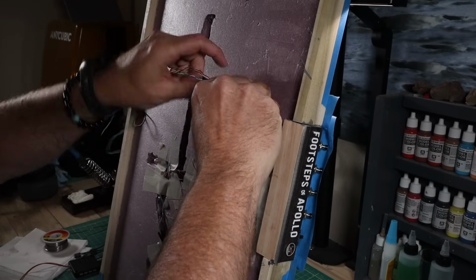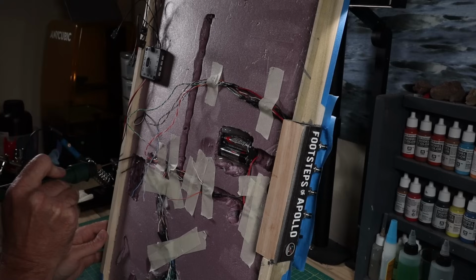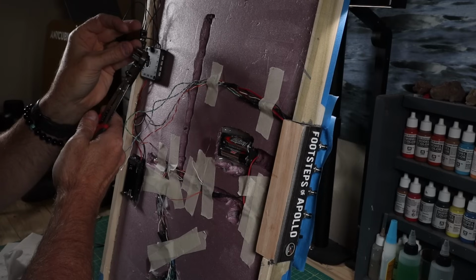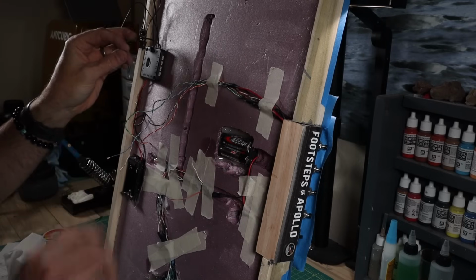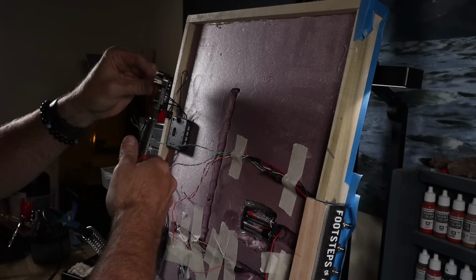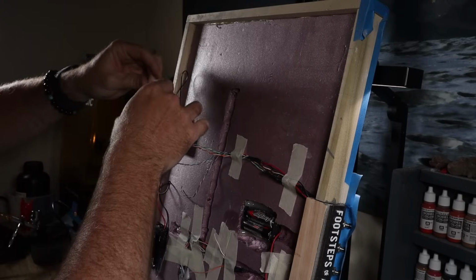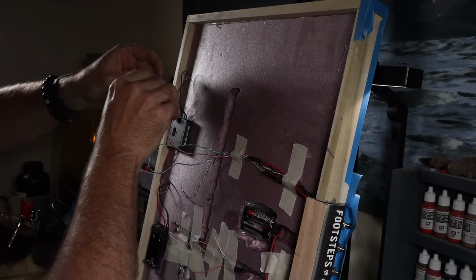With the end in sight, I needed to wire up the sound module. I stuck it on the bottom of the foam and wired everything up with more of the reclaimed Ethernet wire and soldered everything together. This module is able to play 4 different uploaded sounds, with each sound being played at the press of one of the buttons from the switch housing that I showed you earlier.